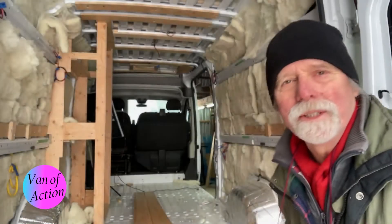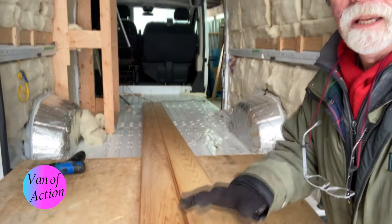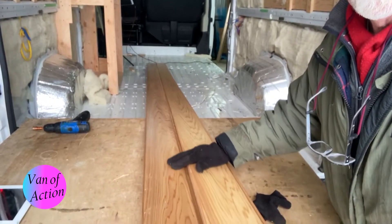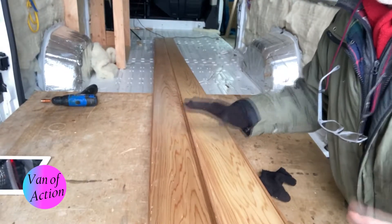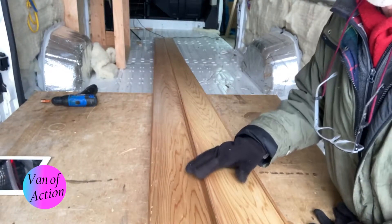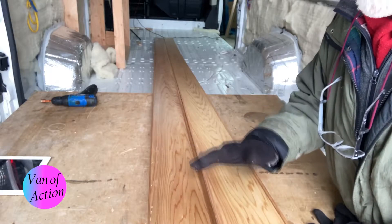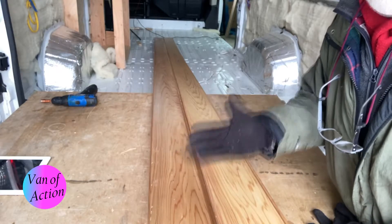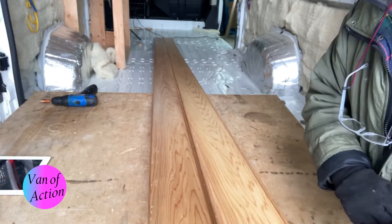It's time to start putting the material on the ceiling, and what we're using is kiln-dried select grade clear cedar. That's just the look we want. Clear means there's no knots — I don't want any knots in the ceiling. I was able to buy lengths long enough to go from one end to the other, so there'll be no joints in the ceiling. Select grade means it's good quality, and kiln-dried.